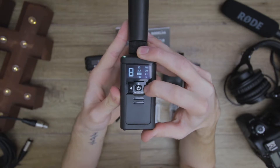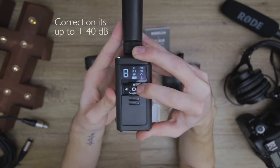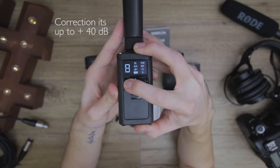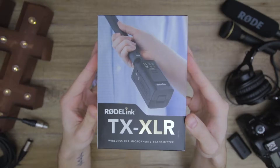It is just a very versatile solution and that's why I really like it. The transmitter can provide 48-volt phantom power as well as 12-volt phantom power for lapel mics. It also has a +30dB gain, which is great because you can turn the gain up on the transmitter and then turn the gain down on your DSLR camera — so you won't be using that crappy internal preamp and you won't be getting that nasty hiss.